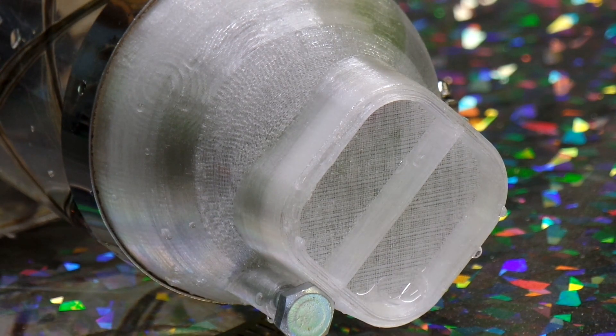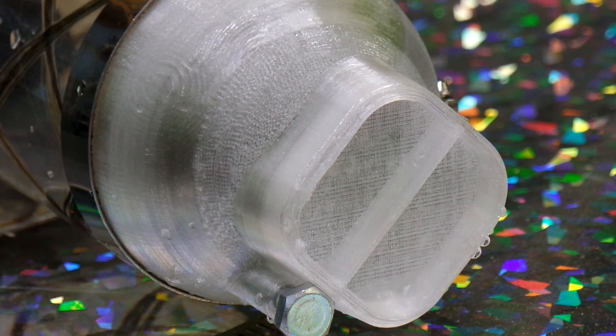It turns out it doesn't hold pressure. So I melted some paraffin into the little holes in the 3D print and that seemed to actually hold water. Here I am doing a dunk test just to make sure that I got it. I really like the look of the basalt fiber here. It's interesting how the plastic turns reflective — total internal reflection kicks in when the light rays bounce off of the air layer inside there, but not the basalt fiber.